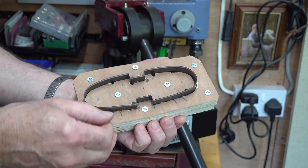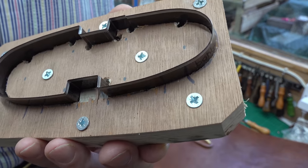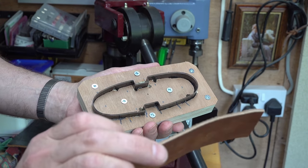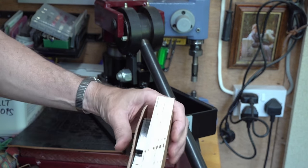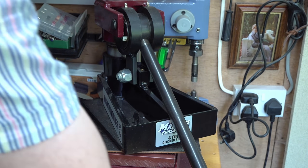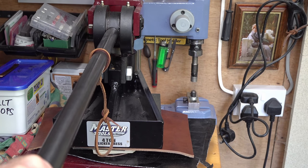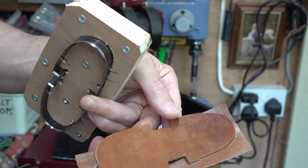I've got one of the clicker dies I made — it's a bit of two-point steel rule die mounted in a block of wood. I'm going to use this to cut out a shape in this bit of leather I've just been thinning off. It's a complicated shape, so it's quite useful having a die that will do this. Using my 4-ton master tools press — there it goes. That's cut that shape out very quickly and easily.